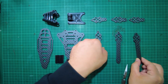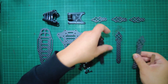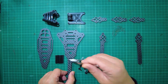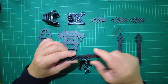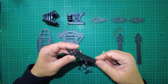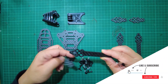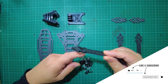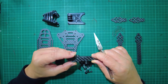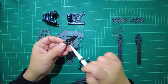There are two kinds of arms — these two arms have the same hole pattern, and there's also this arm which has a bigger hole; this goes to the back where one of the aluminum standoffs goes through. With a Y6 you just have three arms, and the design is quite nice for the motor holes. You have holes for your motor screws and these larger holes — you can mount one set of motors on the underside of the arm, with screw heads up top, and align the other plate to mount the second motor, so you have one motor on top and one at the bottom.